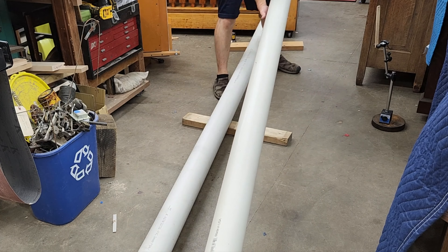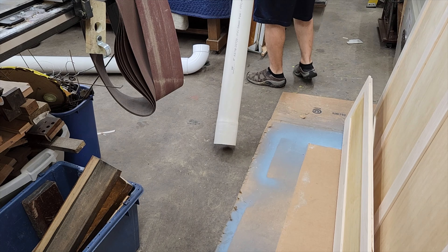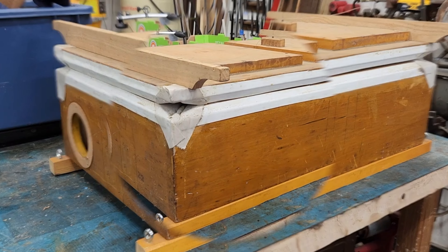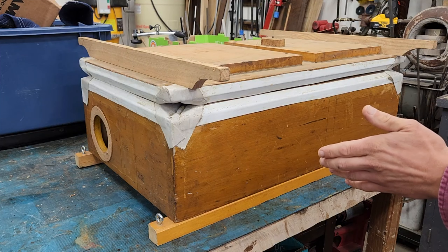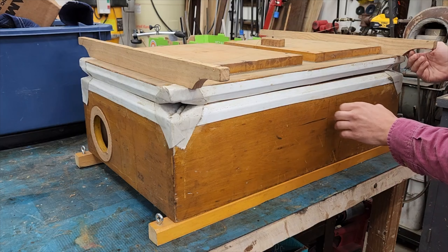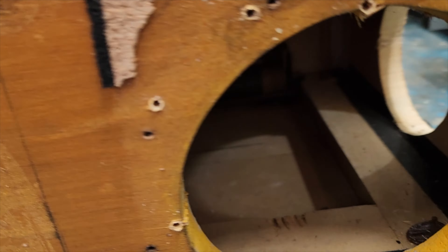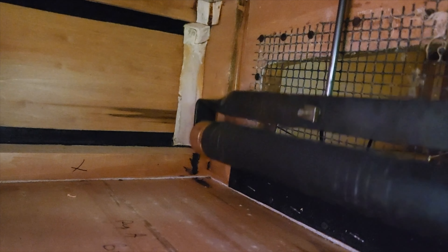Now, 20 feet of line in my shop is asking quite a bit, but after finding a place to lay it temporarily I was able to connect the regulator. What's a regulator? This is the same type of regulator I'm using on the photo player, and it's essentially just a box with a sealed but movable top. When we introduce pressure into this box, that top lifts up, and it moves a roller which covers a screen.